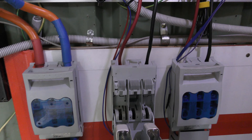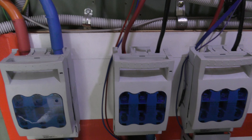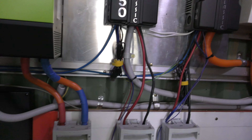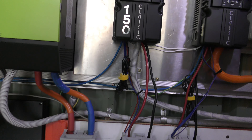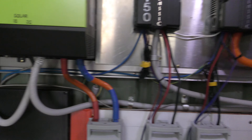That's got them both done. Some people think these arc and spark when you close them — you just get them and close them firmly like that and there's no arcs and no sparks. Then we just turn the solar back on and that's it. Now it's got double shielded cables on. They were very stiff by the way — not loose and floppy like the other Cat 6 cables. I guess that's the shielding in them that makes them so stiff, so just use gentle curves if you get the double shielded cable and no severe bends and you'll be fine.